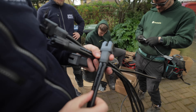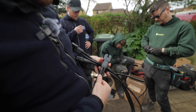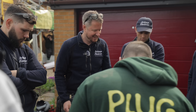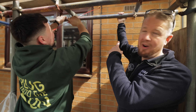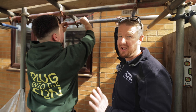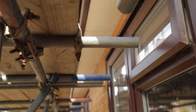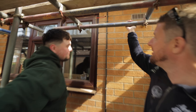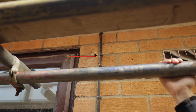These are the Enphase branch connectors — they basically just plug into the side of the Enphase microinverter and loop in and out between the panels. The reason we're drilling from the outside in rather than going through the soffit is that the soffit is a little suspect — we don't know whether it's asbestos or not, it's certainly some kind of fibre cement board, so we just want to avoid it to be safe. The rod is through the hole and that's where we're going to bring our cables through, down to our mystery battery.